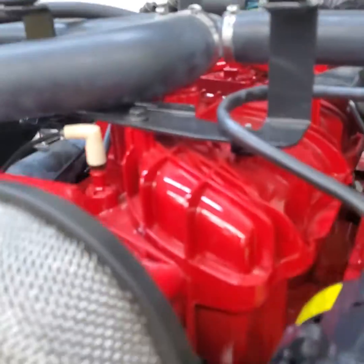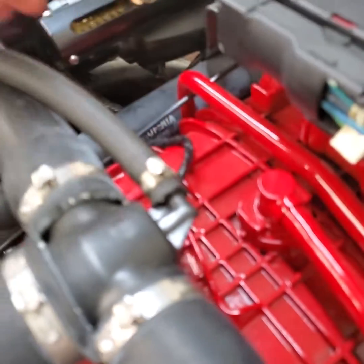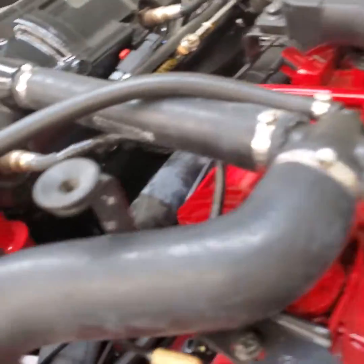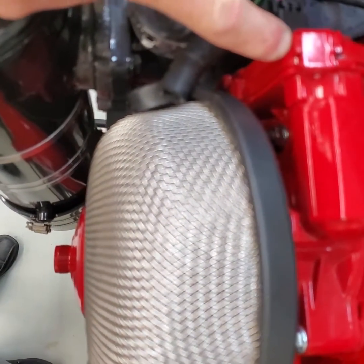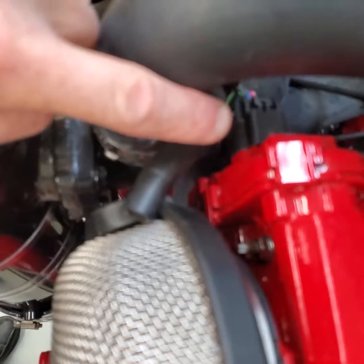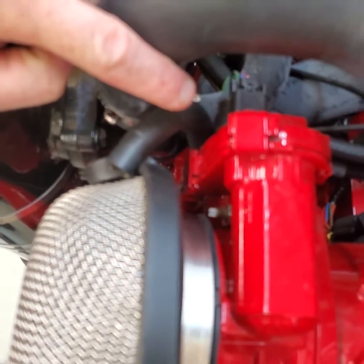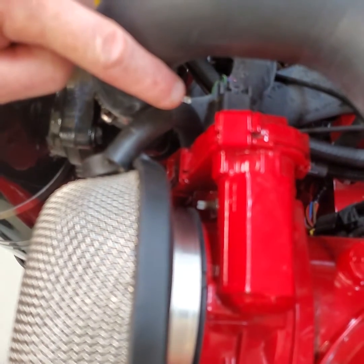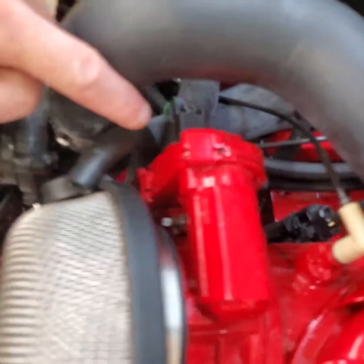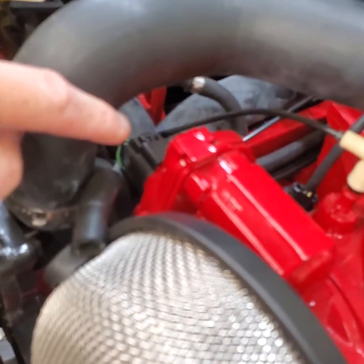The other sensor is up here on the top of the engine — over here is your MAP sensor, right on the top. You also have a throttle body system here, and that throttle body system is shipped from General Motors. The throttle body assembly has the drive-by-wire motor, a frequency-driven motor driven at about 4,000 hertz on earlier model systems — I'm not positive on the six-liter specifically. And then there are two TPS sensors inside: TPS 1 and TPS 2, and those two sensors are fed off 5-volt reference 1.